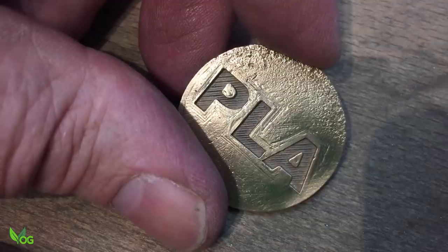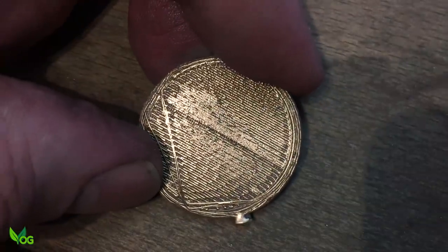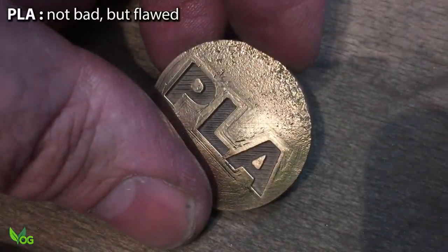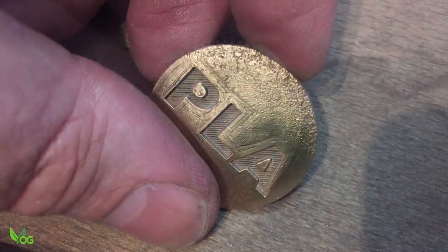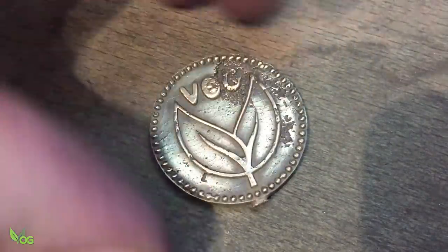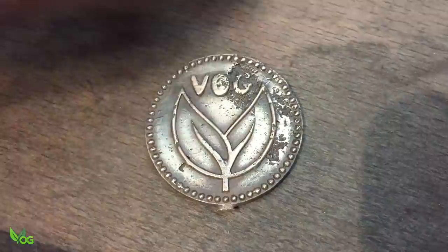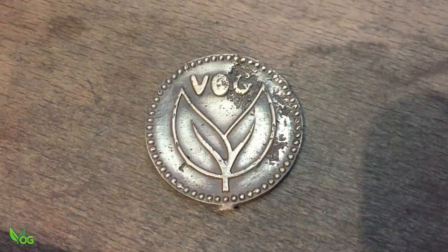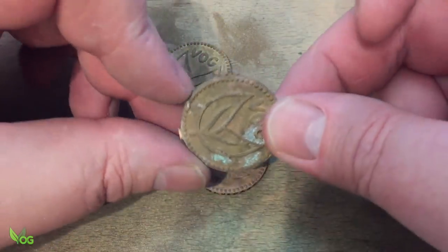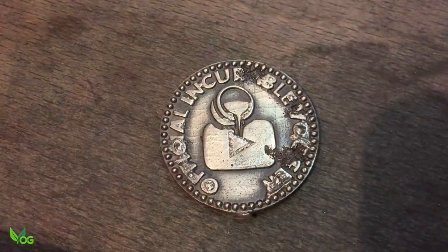This one is still the PLA and at a quick glance, it's not too bad. You can clearly see the layer lines from the printing process, but you can also see marks that weren't on the print — these are evidently flaws. This one is pretty awful and if you hadn't guessed, it's just ordinary 4K resin. It's no real surprise that something not made for the purpose should do so poorly at it. There may be some resins that produce better results than this 4K, and maybe hotter, longer burnouts might help. But that's speculation into something that frankly doesn't really interest me. I'll look to the products that give me the results that they claim they will.